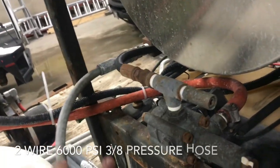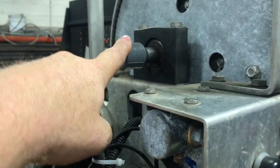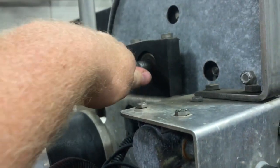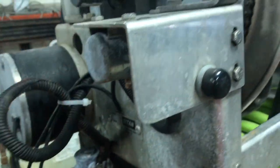Our pressure line comes out of our tank, comes underneath here, and comes to my downstream injector. I use the downstream injector right here and then I've got another bulkhead fitting. Instead of going up into the super swivel — I've done several videos on this — I'll tell you why I don't use a super swivel here: they go bad, they cause our solenoids to go bad. With four trucks we were changing them out at least one a month, and at $60 or $25 a piece that gets old.